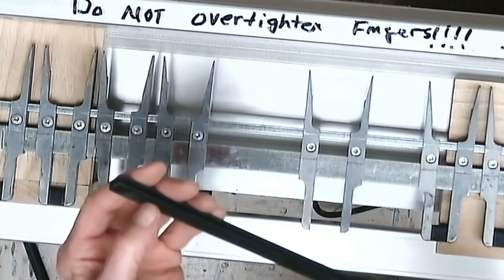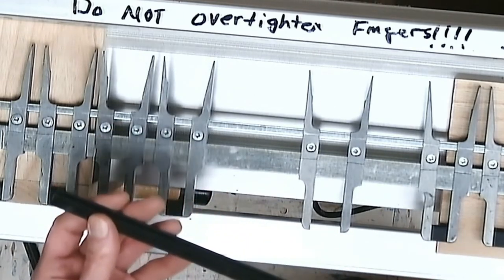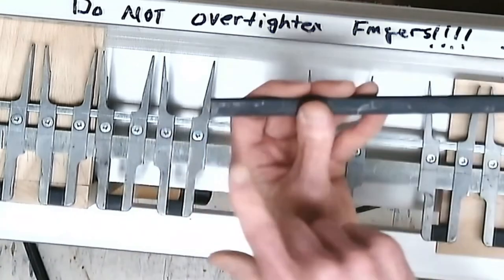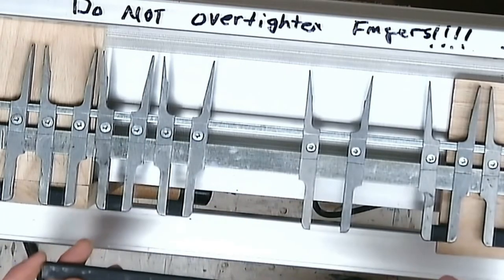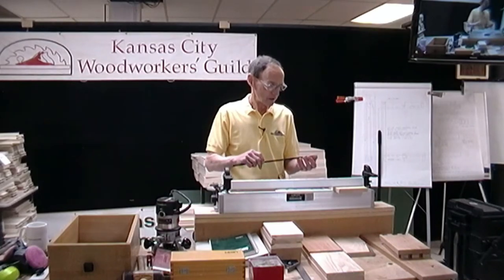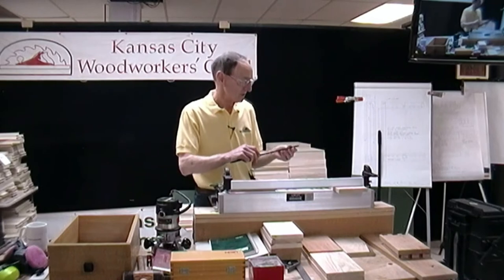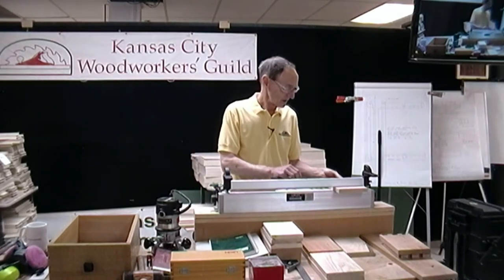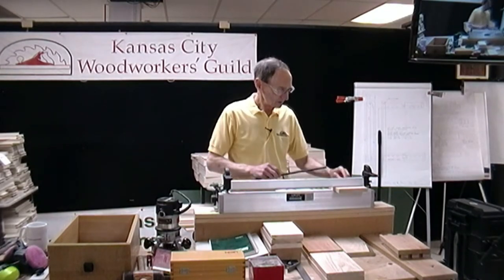And you do that by cutting with a coping saw, or I've used the radial arm saw with a little hold down device, keeping my fingers well away from the blade, obviously. But if you just try to do it without holding it down, you're going to have these things ping, ping, ping flying all over the place. But yeah, cut them slightly shorter than the distance between the shoulder of each of the guide fingers, and then they just shove in there.